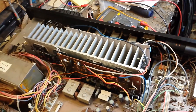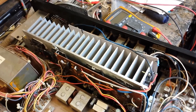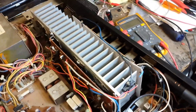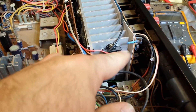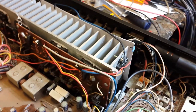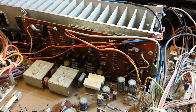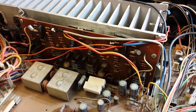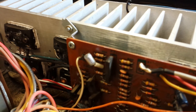I've taken a solid heat sink from a Denon home theater receiver, which required me to notch out the frame so that I can sit the heat sink down. The thermal fan switch got moved to the furthest side from the fan so that when the fan kicks on it doesn't prematurely shut off because the sensor gets cool before the rest of it does. I had to turn the board 180 degrees because it used to face in the opposite direction, and the output transistors were at a right angle per the board to the heat pipe.